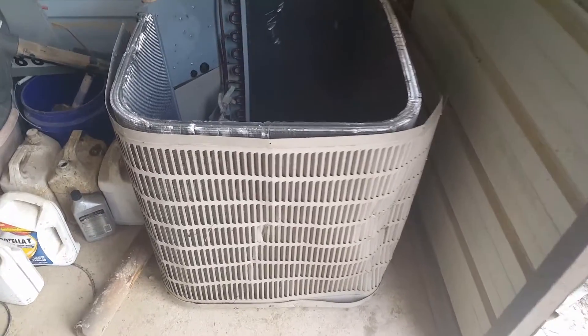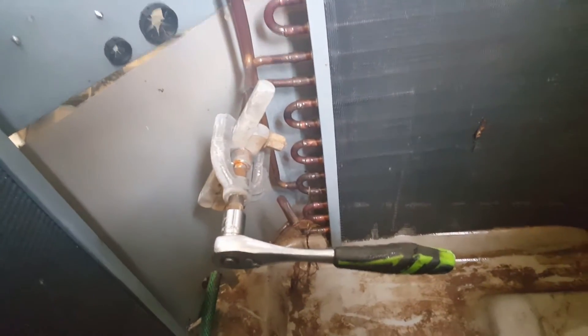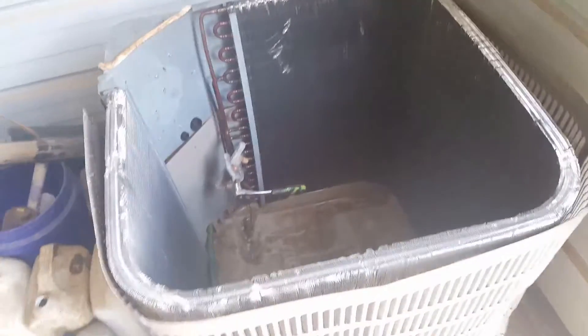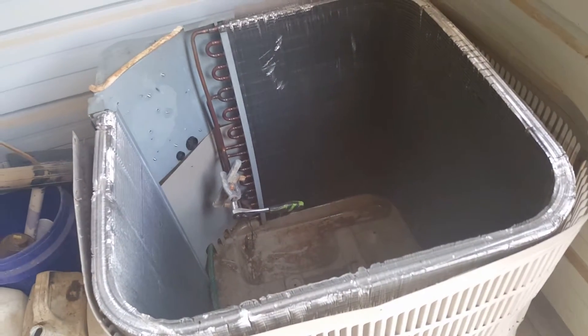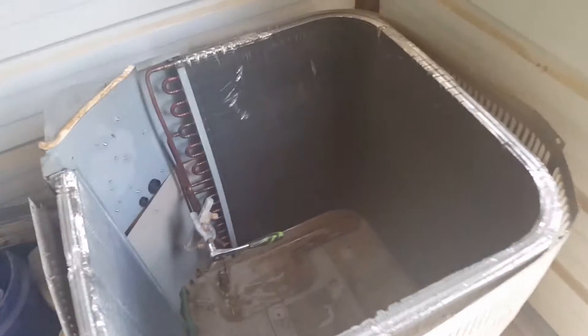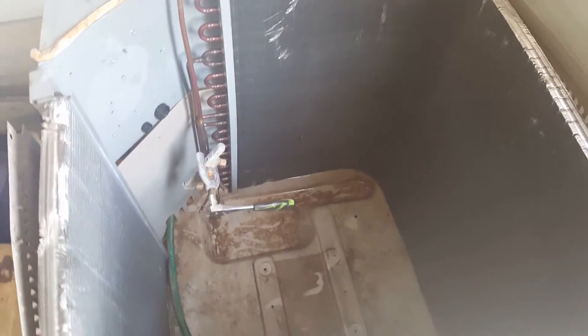I got it moved into the shop. I'm putting a flare on this pipe so when I hook the water hose back on, it'll stay. The drain line down there I might run outside or just let it go on the floor — the concrete is sloped back a little so it'll drain out pretty good. Another thing about air conditioning, especially in high-humidity environments: you're gonna get condensation and sweat on the coils. So think about that — put a pan under it. There are holes all through the bottom, so think about that before you stick it in your shop.